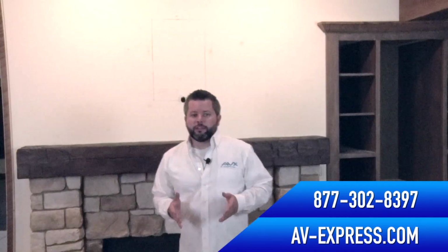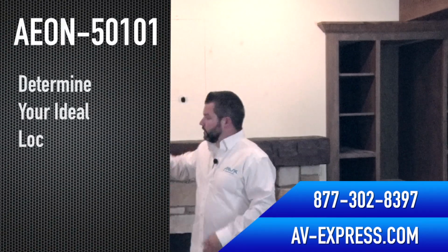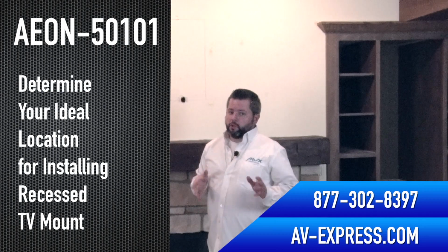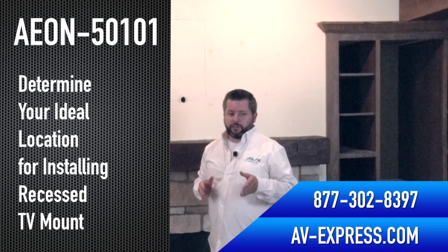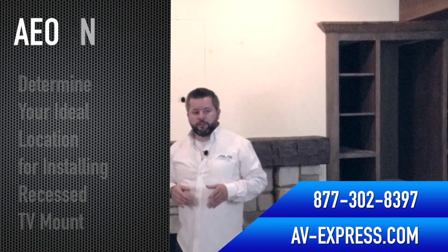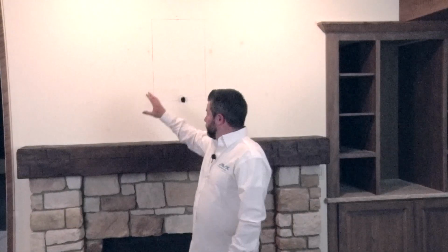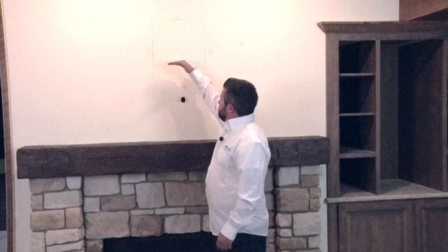Now the first step is going to be to determine your ideal location for installing the AEON in-wall TV mount. This will depend on a lot of factors, mostly how far you're going to be sitting away from your TV and the location of your studs. To determine your ideal viewing height, you're going to want to measure the distance from the ground to your eyes when seated where you'll be watching TV. Now measure that distance from the floor to the location where the mount will be installed and mark this on the wall. This will be in the vertical center of the backplate once it is installed on the wall. It will also be the center of your TV screen once it is installed on the AEON in-wall TV mount.